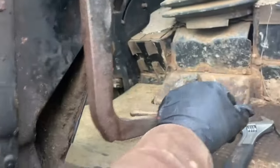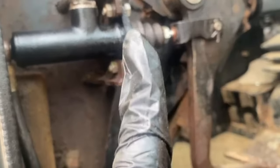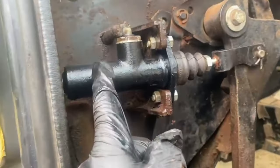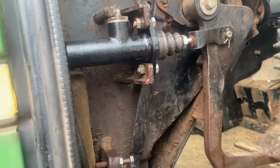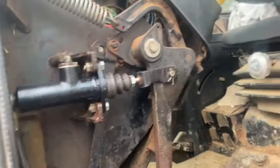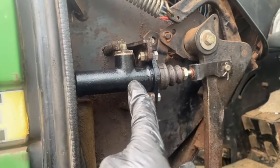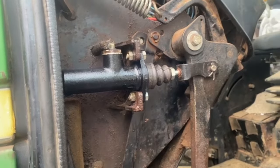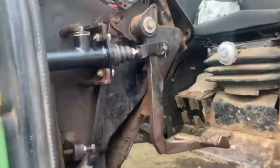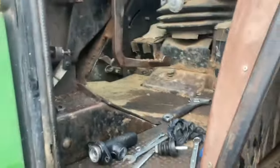We've got a pedal, which is nice. The problem is the pedal goes around past the stop. I reckon that's where most of the problem is — if it keeps going around, it pushes the piston past where it should be against the hole, so the hole scratches the seal. Even one little scratch on a seal can ruin it completely. You can get rebuild kits, but a genuine one was £218 — John Deere special.